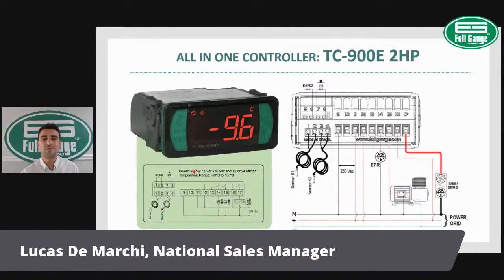One thing that I would like you to note is that the TC900, like most other Full Gauge controllers, is dual voltage. That means you can power the controller in 110 or 220. So you have a dual voltage controller. In this case, we are powering the controller in 220. We have a hot wire, we have a neutral on terminal 9, and we have the hot wire going into terminal 11. That's providing 220 volts to the digital controller.